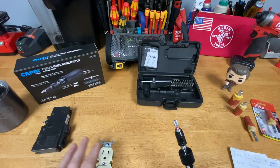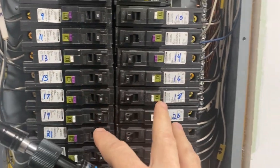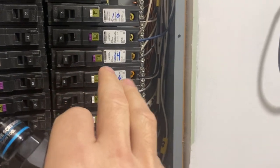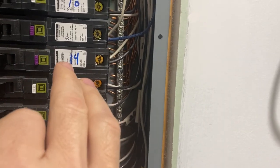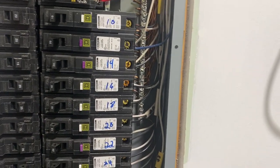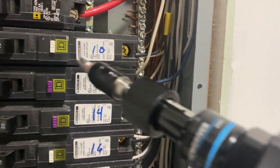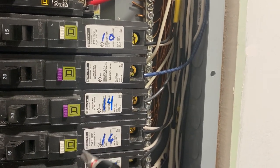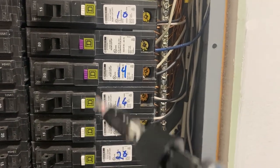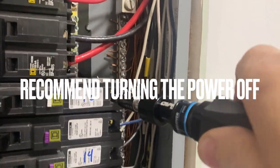Let's go to that panel. I have 21 total 15 or 20-amp breakers in this panel. For anything from 10 to 20 amps, this manufacturer — Square D — says the recommended torque rating is 36 inch-pounds. You can actually see that printed on the side of the breakers themselves. I'm going to show you the top four first and then check all of them, and I'll tell you how many are loose or out of spec. I can also identify under-torqued connections, though I wouldn't be able to detect over-torqued ones.